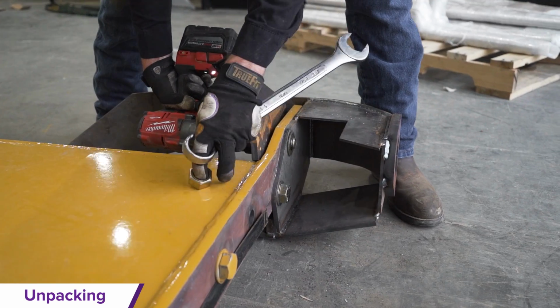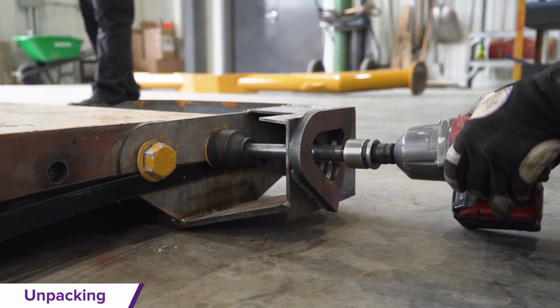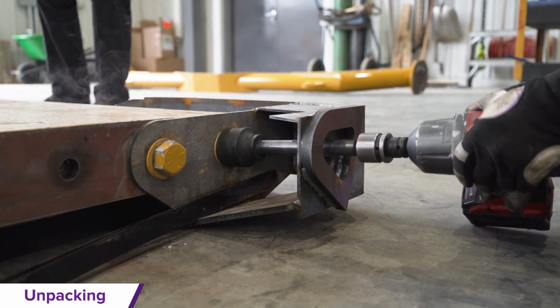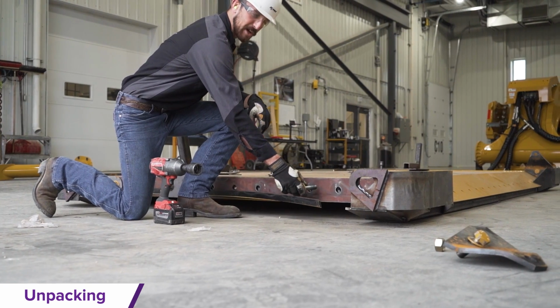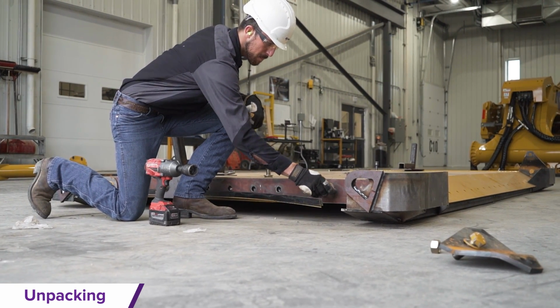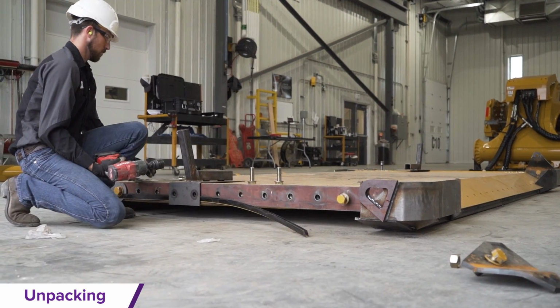Finally, the floor assembly is the last remaining assembly on the small skid. Remove the skid bolts and attach a clevis in both front holes. Attach a 1-inch eye bolt to the rear of the floor for a safe 3-point lift by attaching it to a chain to lift and remove the floor off the skid and place it in your assembly zone.